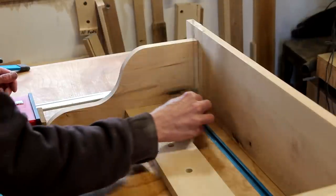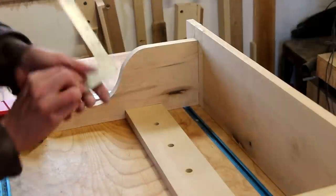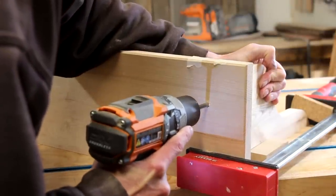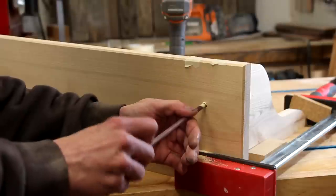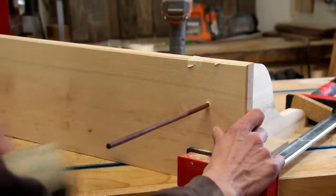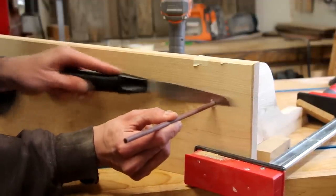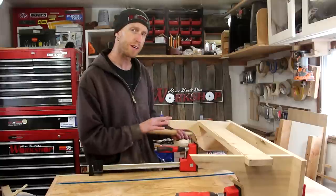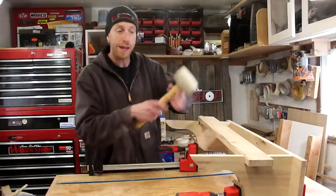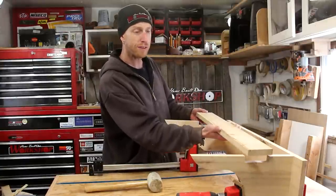We are square! Using that same quarter-inch Forstner bit, I'll drill through the pre-existing hole and into the top of the bracket. Now I've got the side pieces reinforced with the dowels. I'm going to get this back support glued into place.